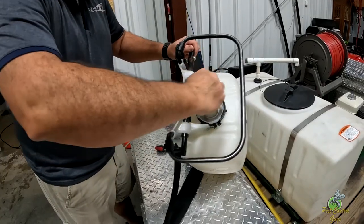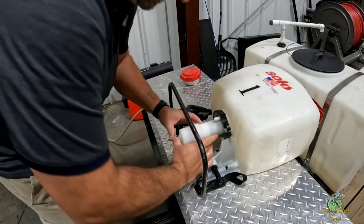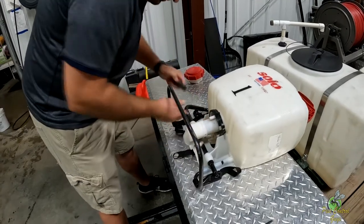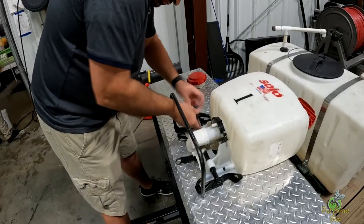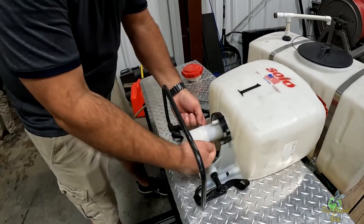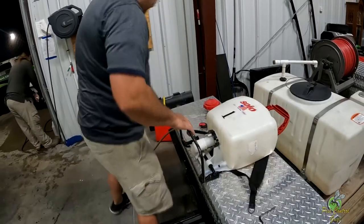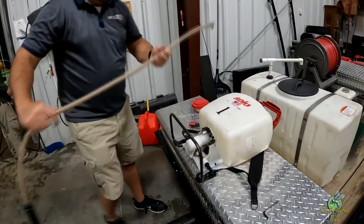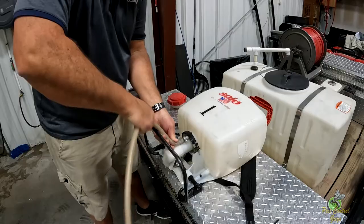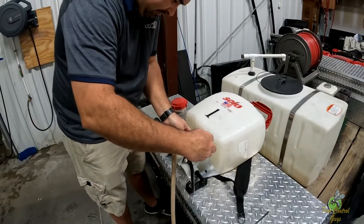Slide that in. This is the hard part because we have to line this back up. So the way this works is when you pump, it's pushing, compressing air in the cylinder and then mixing it with water and shooting it out that hose. You want to make sure that all of your seals are on and everything's connected right. Sometimes these will back out and hit this, and that's a problem, or they'll fall out completely. But that's less likely than water getting to the wrong side of the seal. I'm just going to make sure these are tight, and then we put it back together. This will spread it — get it over those two pieces, put the screw back in. Don't over tighten this one because it's squeezing the whole piston cylinder, and if you get it too tight it'll pinch the piston. Now we put the hose back on. Make sure you don't put it underneath — you put it over. They come with a little plastic hose clamp usually and I usually change them out for metal ones because they're stronger.